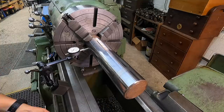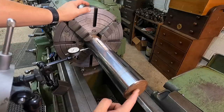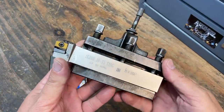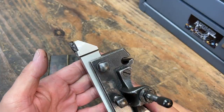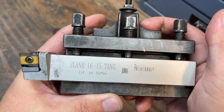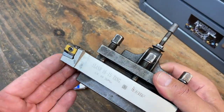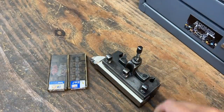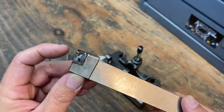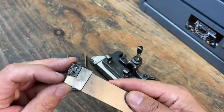Let's move the indicators out of the way and set up our tool. I'm going to show you the turning tool we're going to use to rough it — we'll finish it with a CNMG insert tool. First let me show you this stick tool for the shaft. This is the insert I've always favored for roughing and heavy metal removal rates on the big lathe. The old one I used in previous videos is pretty well chowdered up — it ended up breaking in the middle of a big heavy cut.